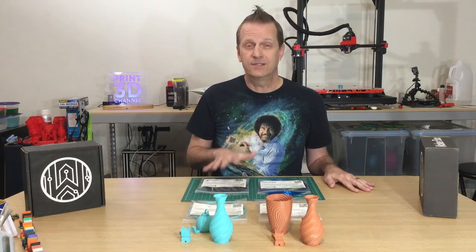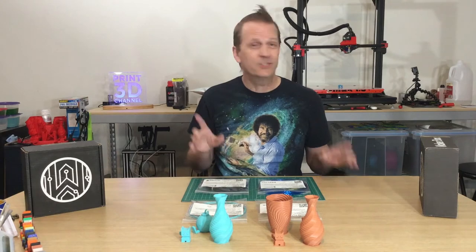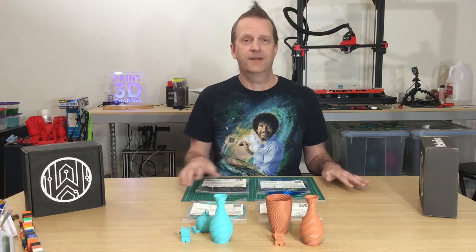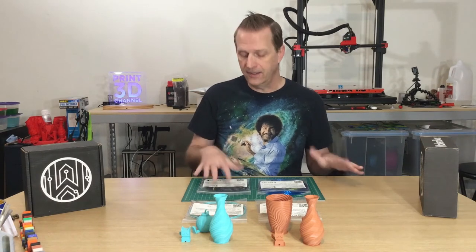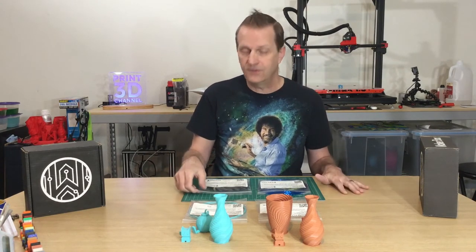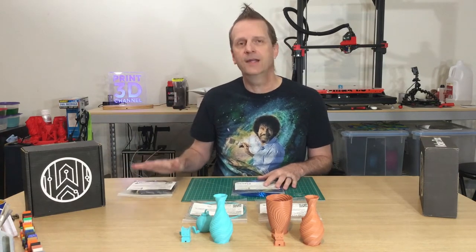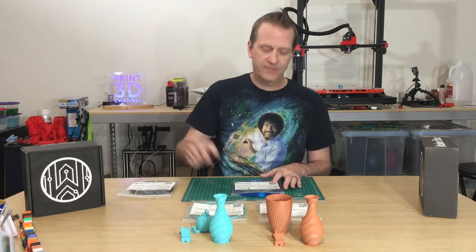Side note — this stuff really does dirty up your extruder. It took me over 45 minutes to clean out the residue. I'll show a little video of me spending time cleaning out the extruder. I had it up to 255 degrees, and this filament's temperature is 220 to 230, so it should have just liquefied its way out using cleaning filaments, but it took 45 minutes and 12 to 14 different cleaning cycles. Pretty dirty filament on the way out. But it's highly recommended and a popular filament from Ninja Tech — I'm sure there's a way to get it to print. If you guys have any suggestions, leave them in the comments.